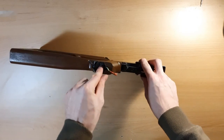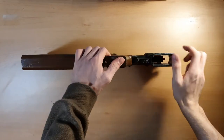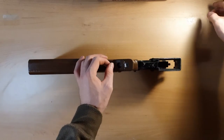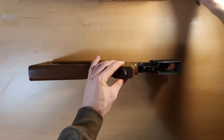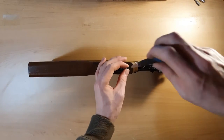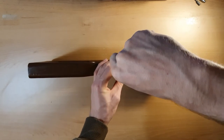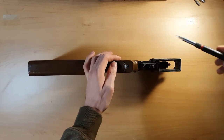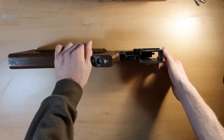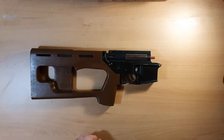Make sure your motor is still spring-loaded and that the cables aren't interrupting anything. The bottom part is installed — secure it with two tap screws, and in the middle there is a thread for the motor height adjustment screw. I recommend taking this screw from an A1 grip because it's metal, however the files also contain one that can be 3D printed.